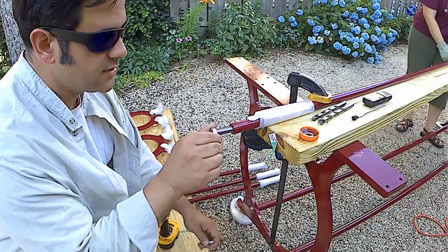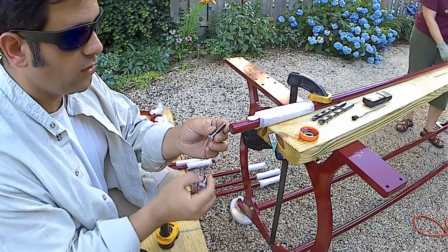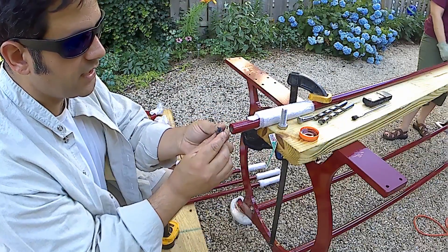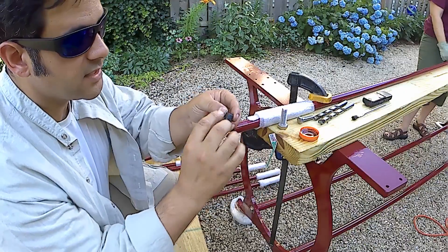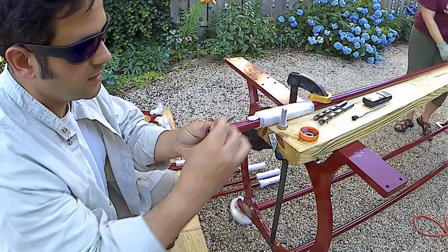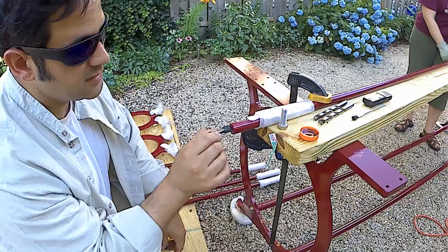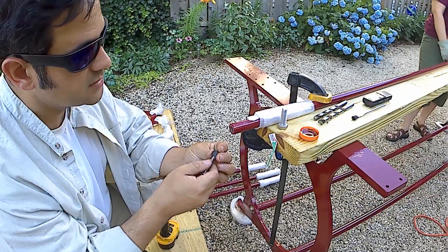What we have here is a little failure. You can see that this is tapped half-inch 13. The problem is the hole in the plates is for three-eighths — that is not going to work. So the solution is this. It's kind of like a helicoil, but it is a solid piece, not a spring. So I've got to open up this hole, tap it, thread it for this, and it will accept my three-eighths 16. So it is an expedient field repair that we're doing right here in the backyard in order to get this assembled and put together.